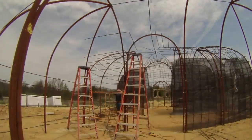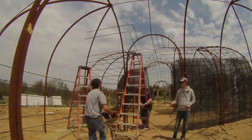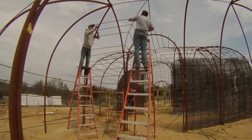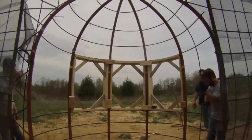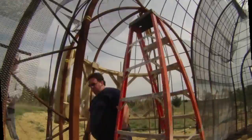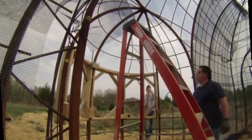For these groin sections we put up pieces of rebar that were bent 90 degrees in the middle. For the apse we curved 20-foot long pieces and then trimmed them at the apex. The trimmings could then be reused elsewhere in the apse, leaving very little waste.